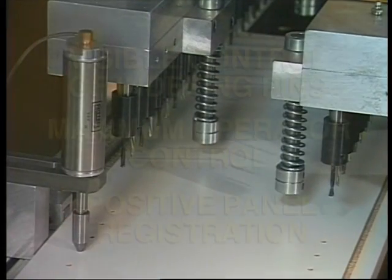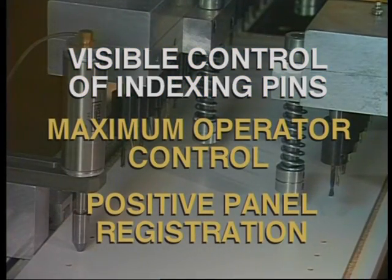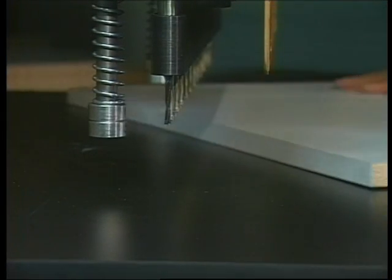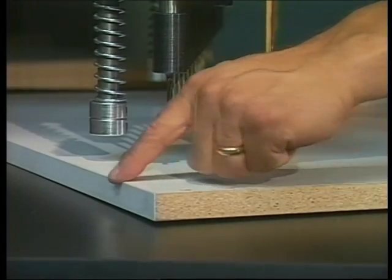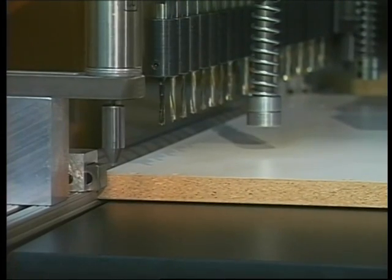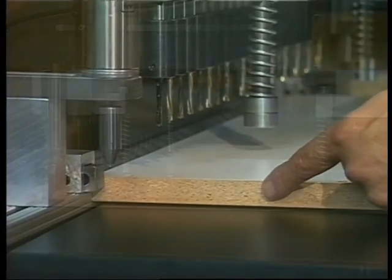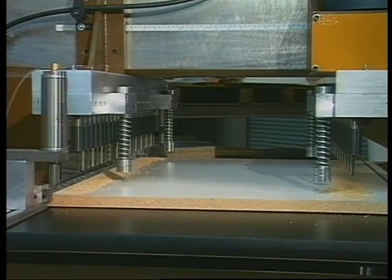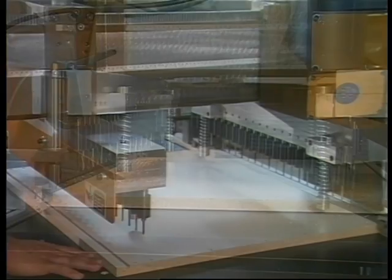Top drilling provides several benefits: visible control of indexing pins, maximum operator control, no lifting of panels during the drill cycle, easy access tool change, and a large surface table simplifying setup. To begin the line drilling, set the right and left stops using the finished face edge and the bottom of the bottom shelf for all referencing. For simplicity, use a common standard offset. System manufacturers make this choice based on hardware used.